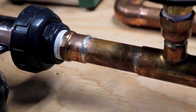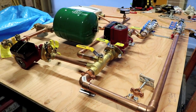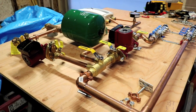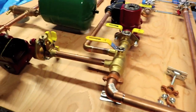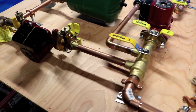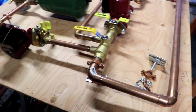One other thing I was thinking about: I did just recently pick up an old indoor-outdoor wood-fired boiler on Craigslist, and I like the idea of possibly adding it to the system. So I'll need to have a spot reserved for future expansion. I might add another T or a purge valve just like this one right here, except I'd add it in here or here, so I could basically bypass the electric heater and instead put in heat from a wood boiler. I might stub something out here, so I'm going to save those two pieces until last.